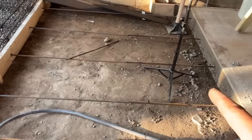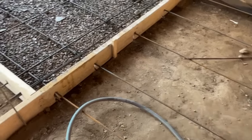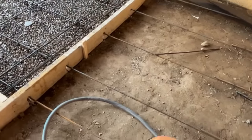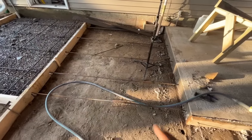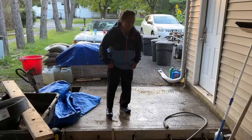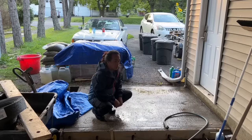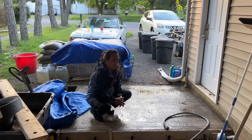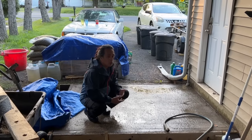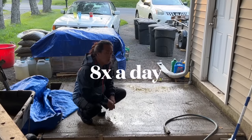The form on this side uses the same wood I used before — I just slid it over, but since I won't be able to slide it out, I notched it, as Greg Vancom recommended. Some cement will come through the hole onto the side, but as he mentioned, it's going to be covered with concrete anyway. I did do this slab on my own, but unfortunately my new camera didn't record it. It wasn't as messy as the first slab since that was more of a learning process coordinating with my dad. It came out pretty good. It's now day seven — I've been watering it and placing a tarp over it to help with the hydration process.